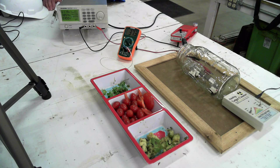And how much are they? The ferrules are $1.26. So $2.50 in ferrules, and for this short reactor, it's about $8 for the tube, and another $3 or $4 for the rods. So it's a $25 reactor that you can build in an hour. The thermocouple, with the fiberglass sheath, they're $5 or $6. Yeah. If you want a calibrated one, that's a different story. But the whole assembly is easy to build, it's inexpensive, and it seems to be reliable.